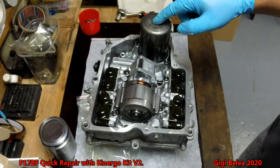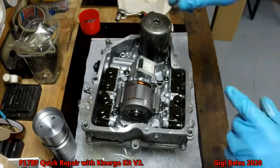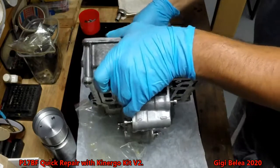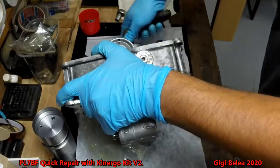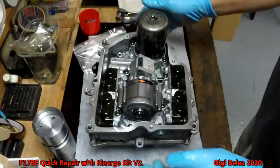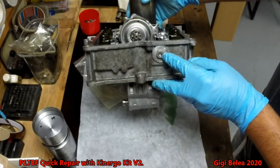So we have to remove the oil accumulator and place the one from the kit inside. These are usually a pain to open if they still have some pressure on it. Remember: before you open this and try to change things, you have to drain the oil — there's a small plug here you have to remove and then you can drain the oil.